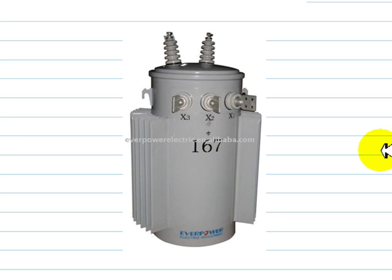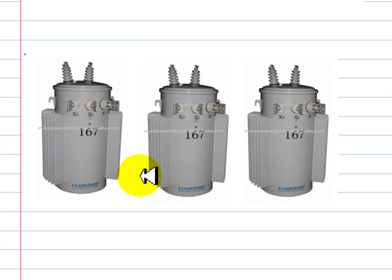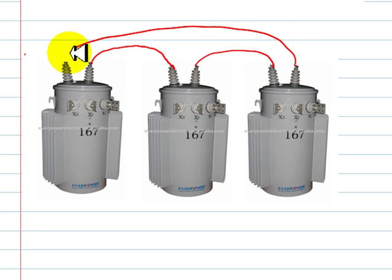In this exercise we will be working with three single-phase transformers. There is a high voltage or primary side — this distribution transformer is rated for 15,000 volts (15 kilovolts). It has a secondary between two connectors rated for 120 volts, and a tertiary between another pair of connectors also rated for 120 volts. In our exercise we have not one but three of these single-phase transformers, connected on the primary in some way and also on the secondaries and tertiaries.